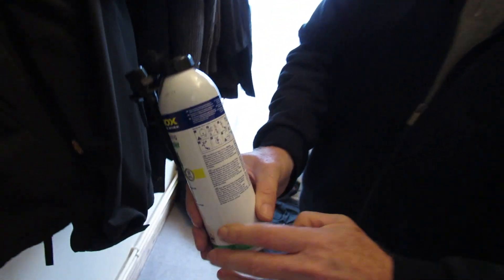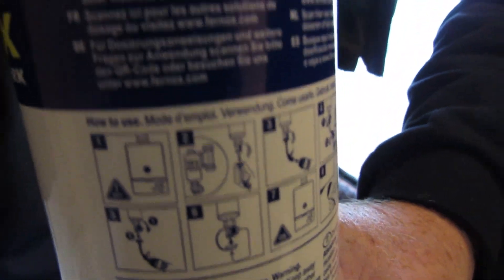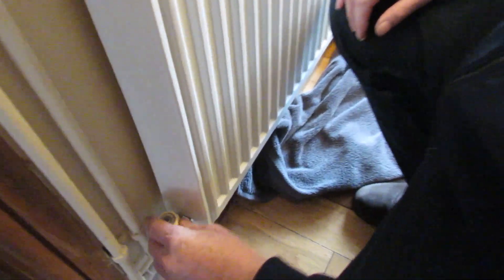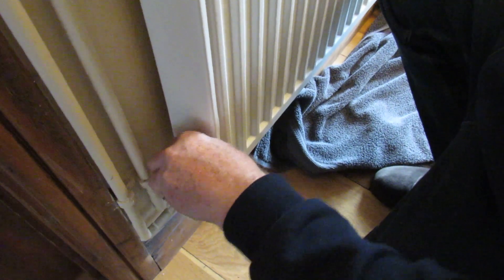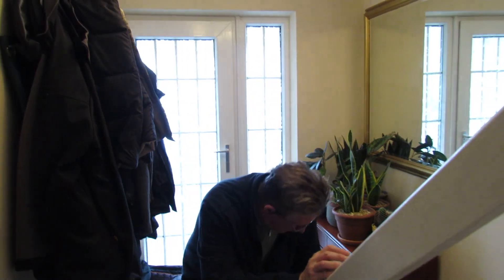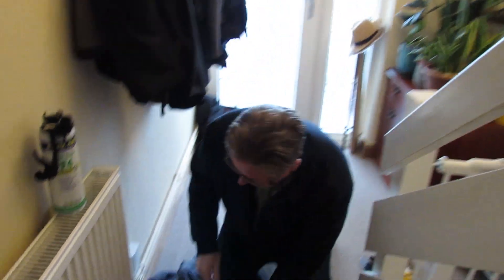Downstairs now with the radiator, ready to try and pop this in. We've noticed on the back it says about a TF1 filter — a Fernox filter — which fits with the other bits provided for different types of boilers. We're going to pop it in the radiator. First, turn this valve off — remember how far it goes, virtually wide open. Now we need to take about 400ml out of this radiator to make room, so we're going to create a small leak here to drain it.